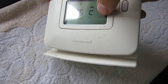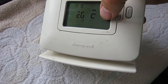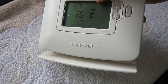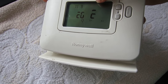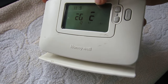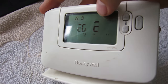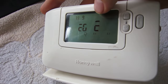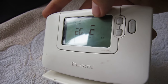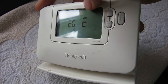The way these displays work is there's a driver chip on the back of the glass - well, it's not attached to the glass. It's on a circuit board mounted closely to the glass, and there's a flexi connector around the end. That carries all of the lines, and each segment has two wires going to it, and if they're driven clocked in phase or out of phase determines whether you see it as a light or a dark segment.